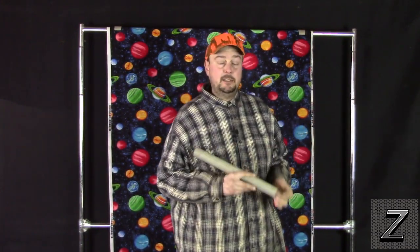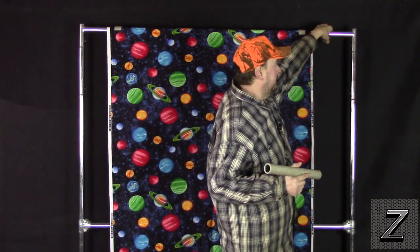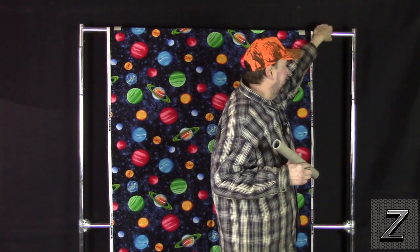And if it is a little loose, what you can do is heat it up in some boiling water the first time you clamp it on there. And what that'll do is it'll stretch it out a little bit, or if it's a little too big, you can put it on there and clamp down on it, and that will shrink it down a little bit. Now you can't go to big extremes, but you're going to be able to find a PVC that will work.